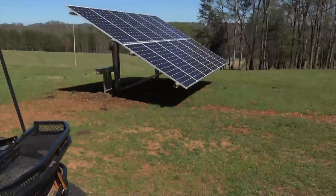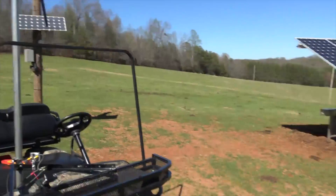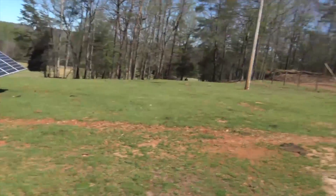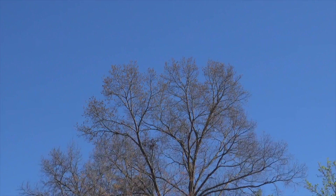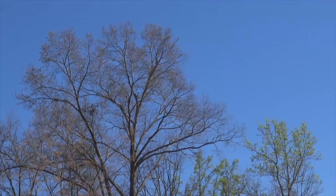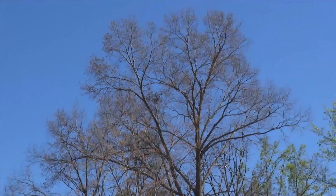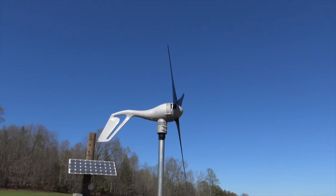Our wind charts are not very good — I'll post the wind map here shortly. But I'm going to put one up here anyway, up on the top of that oak tree whether it kills me or not. I'm going to put one up on a tower out of that tree — it's the tallest structure on my property. Maybe a 30-foot pole sticking out of the top of that tree, anchored to all the branches with cables and guy wires to make some 48 volts.